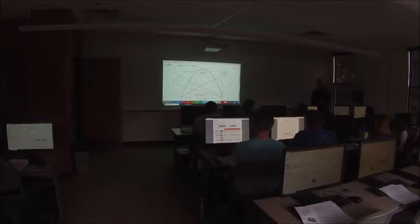And actually, the smoke that comes out of a motor when you burn it out is from a very thin epoxy or enamel coating on the wire. There's a thin coating on the actual wire before they wind it in the motor. That smoke is that coating burning off, because the wire got so hot it vaporizes the coating. Once that coating's gone, the coils sitting next to each other start touching and make an electrical short, and then your motor doesn't work anymore because it's not a coil, it's just a lump of copper.